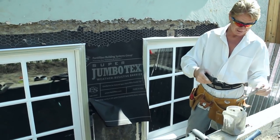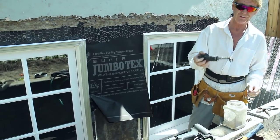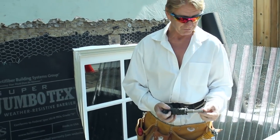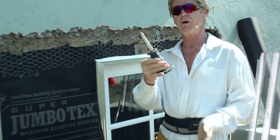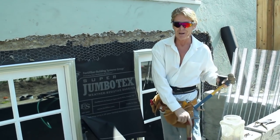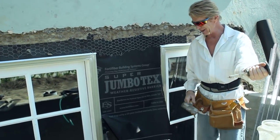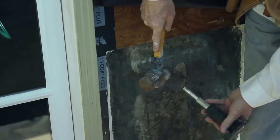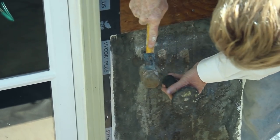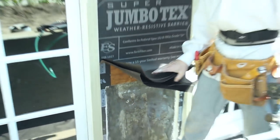This magnet right here — I stick it into my little jar of concrete screws, and you see that. The magnet is to put concrete nails into cinder block, concrete, brick, rock, stone — you name it. The magnet holds a half-inch concrete screw, and you can't just use a hammer. You've got to have a little slug. This is made like this so you don't lose a fingernail — how many fingernails have I lost? Quite a few. What you do is you put it like so, tap it, and then after you tap it and get it started, pull it off — one or two hits only. You keep hitting it, it'll just destroy it. So by the time you do this over paper, that paper's gone. It creates a huge hole.